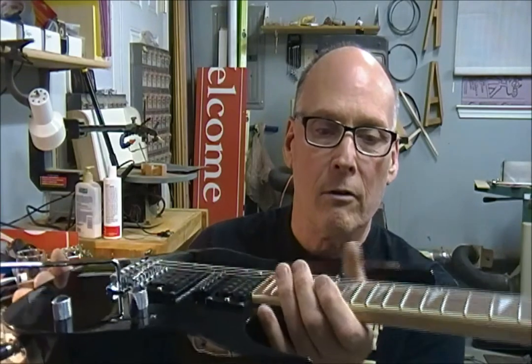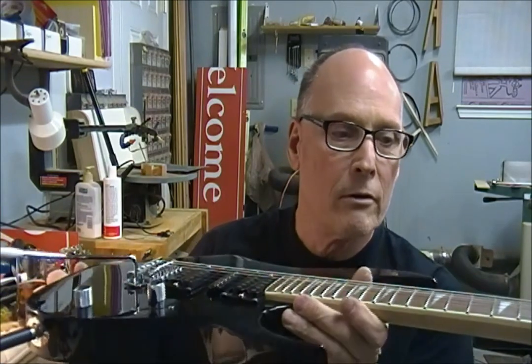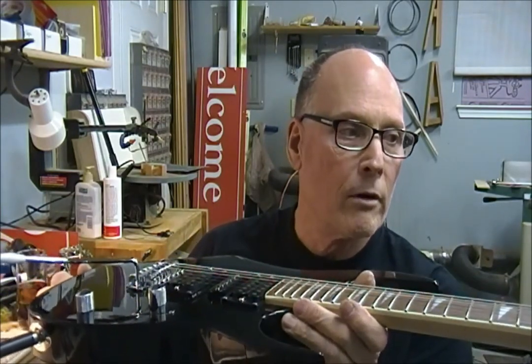I only signed on with this guy for just a really cheap job to get the thing playable, because the action was so high. So I'm not going to chase those high frets like that. This thing needs a fret level. I could just pick and choose individually, but that would take way more time than he wants to pay me for at this point. So maybe down the road, if he gets a few bucks together, I'll just level it all for him and clean it up quite a bit.